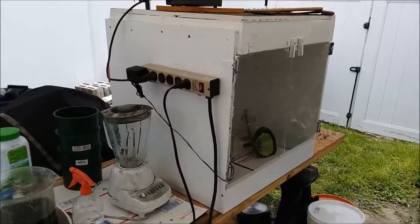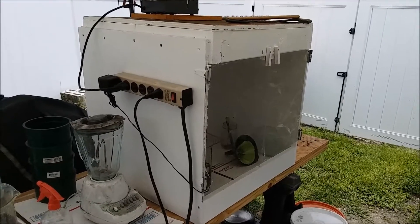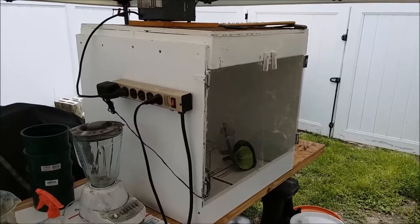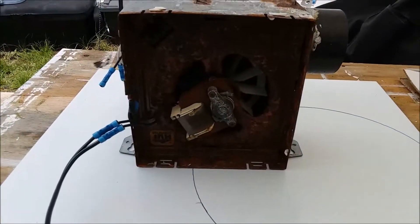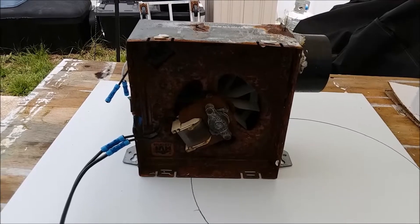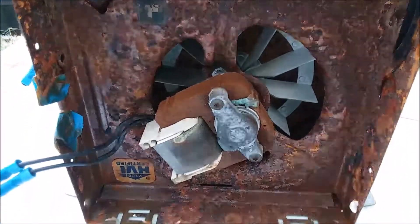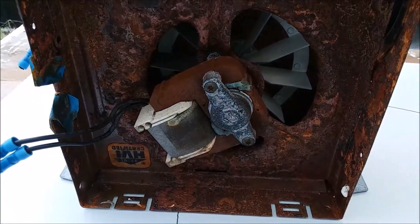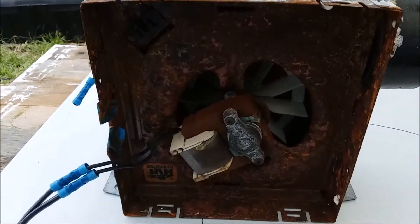Hello YouTubers, time for another update on my homemade fume hood. There's been a few modifications. First off, the bathroom vent fan I used did not last long — just about three weeks and it was done. You can see how bad the corrosion is in there. I don't know what went bad on it, maybe some of the motor windings or something, but it's acting like it's open circuit so it's not running anymore.